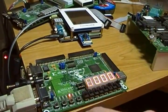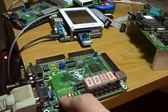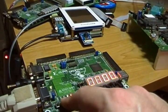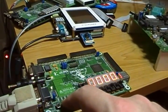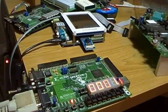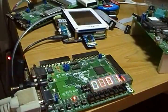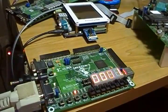Nothing's happened yet, but I'm in deposit mode. When I hit the action button, it's going to stick that five into memory — using the RAM on the Spartan board, not on the chip itself, so there's some RAM underneath this board. It's going to increment the program counter, which is the register we're looking at. Now the program counter goes to one. That five, by the way, is an increment accumulator instruction. One of these LEDs is under program control — I call it the QLED after the old RCA 1802 Q bit — and there's an instruction to toggle it. That instruction is 0x24.